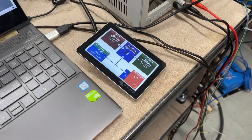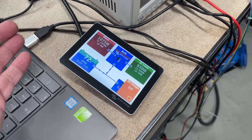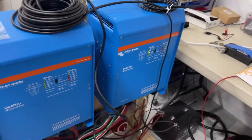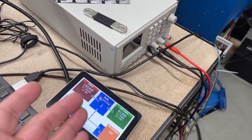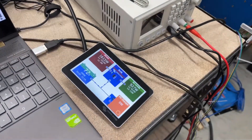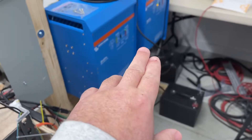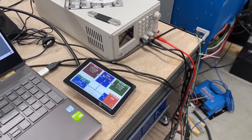If I shut this off, it's going to go back to charging the battery — and that is absolutely perfect. That's exactly what I wanted. The Victrons are not complaining; it's back into bulk charging mode and not complaining about the generator. And that's only at 15 amps, so I should be able to ramp this up quite a bit more. I'll probably just get the generator wired into the second input and make sure this is all configured to transfer over to the generator and that it works at those higher currents, but I can't do that until the generator has been running for a while.